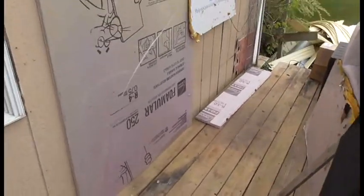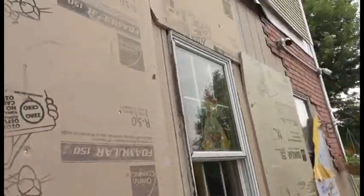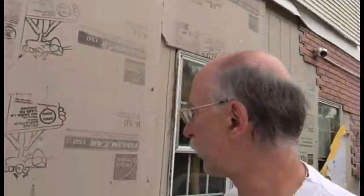So what I'm going to do is put on the rest of the insulation board. Like I said, this is pink board. You don't have to do that, but if you're already going to be doing the wall, an extra added layer of insulation doesn't hurt. This pink board is R5. I may pull all that off and use foil board. Not really sure, because foil board has a rating for 1/2 inch. Yeah, no, for 1 inch, I believe it's 6.2, 6.7 or something like that. But either way, I already bought the foil board. I have all that.